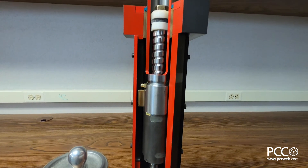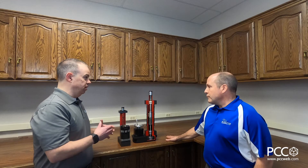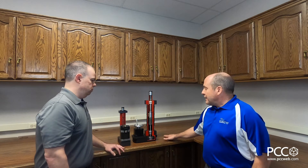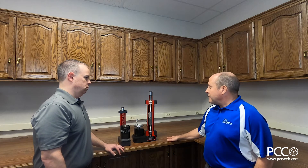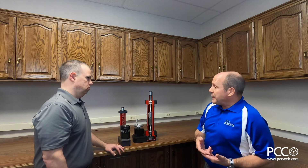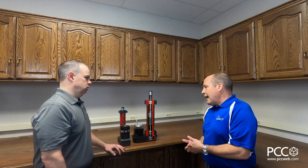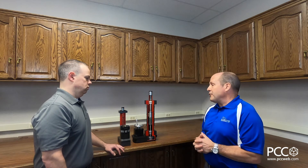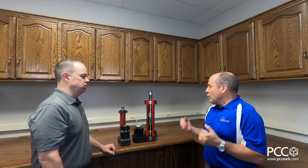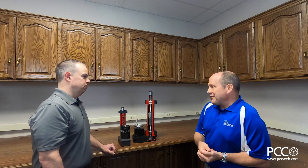There are a couple of solutions for linear actuation — this type of actuator with the ball screw, and then there's also a linear servo motor. Where would you use one over the other? Linear servos are very dynamic, but the big drawback is they don't have mechanical advantage. You can get higher speeds and more dynamic motion, but without mechanical advantage they won't last in higher sustained force applications. So if you have to continuously press or hold up 500 pounds of mass for any length of time, a linear servo really isn't a good choice.